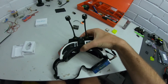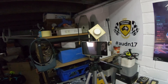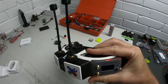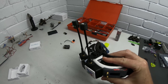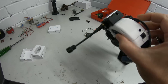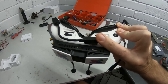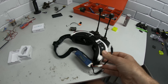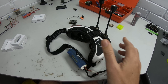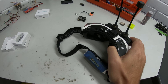You've got a goggle module now — everybody wanted a goggle module, ground station bad. So now we have a goggle module, and they've done a really nice job on this. It's got two patches built in and you can stick two more on there. The connection is via HDMI on the bottom, and you can either power it off your balance lead or use another lead which has two plugs and can run off a 3S or 4S in your pocket. It's got a regulator built in.